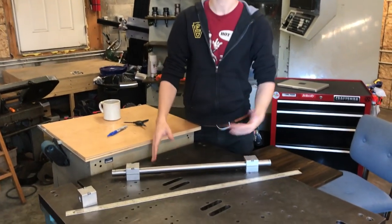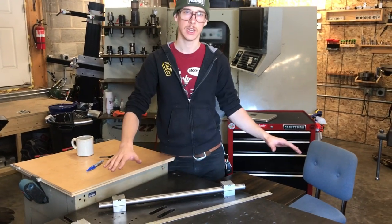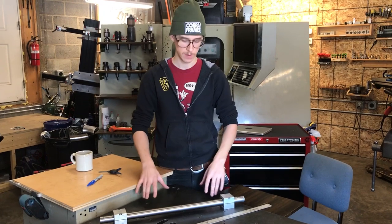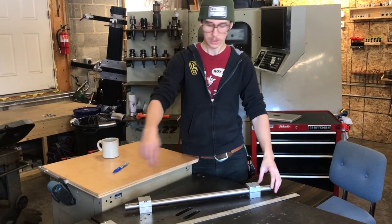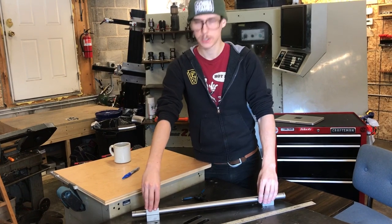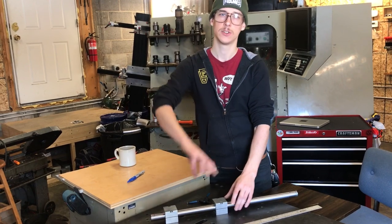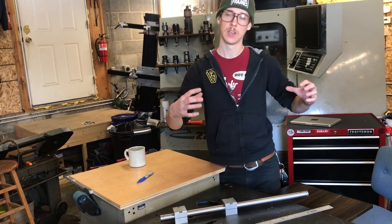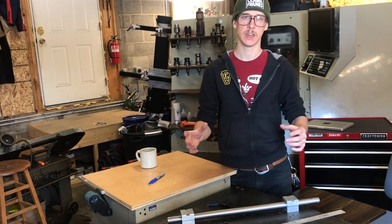You would just set them both down on a flat surface — this is Blanchard ground steel, but you could use a less exact flat reference and it would still work fine. You could use the machine table of your mill, or even a workbench is usually going to be flat enough. The flattest surface you have in your shop that's long enough is going to be great. You just tighten them both on there at the same time, leaving enough room for the hole saw to do the cut. If you need to, you can loosen one at a time, shimmy it partway down the tube, tighten it again, and as long as you don't do that too many times, you're probably still going to be pretty close on your registration for the phase of things.